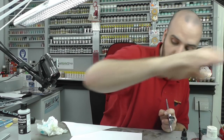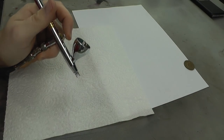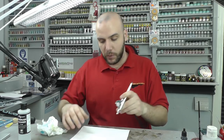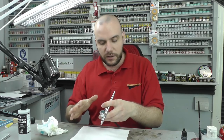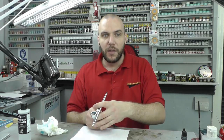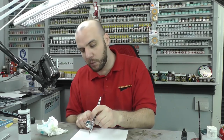On a kitchen paper towel, pressing down just gives you air — even with paint in the colour cup, nothing else comes out. When we pull that trigger back, we start to get paint. One thing you really want to get used to is what I call the biting point — that's where you press down the trigger and as you slowly bring the trigger back, that point where paint just comes out. Just like a car clutch: as you pull the clutch back, the engine activates. That's our biting point — that's what we want to control. Pull back a little further and more paint comes out.